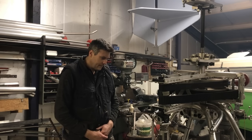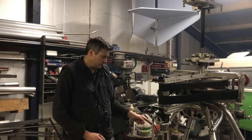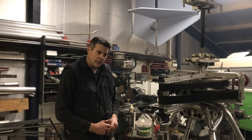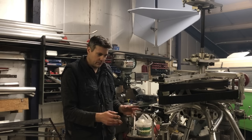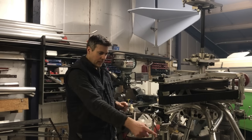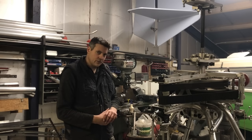First test then — pretty good. There was no binding I could detect. We got to about 700 rotor RPM maximum. There was nothing really I could detect. Maybe right at the top you could start to feel some resistance, but this is unloaded. As soon as you put the blades on you're loading up these bearings in a sideways direction and there's going to be even less force trying to bind it up. So I think that's a good result.